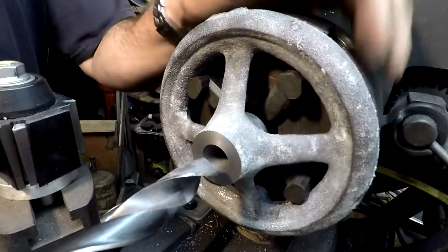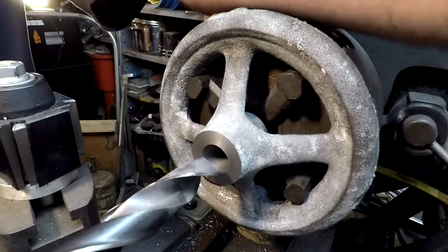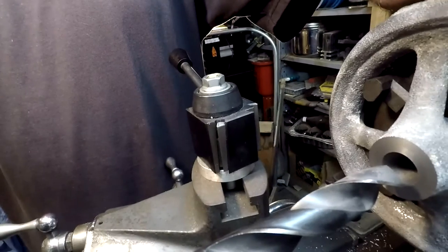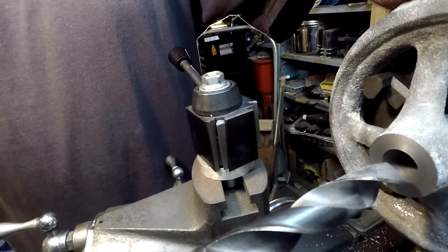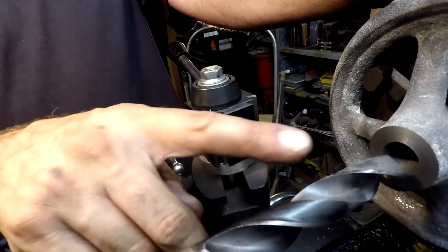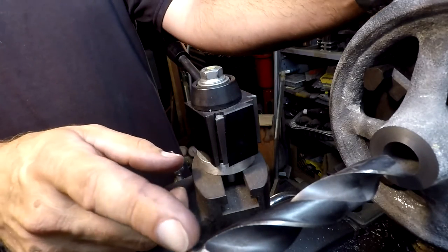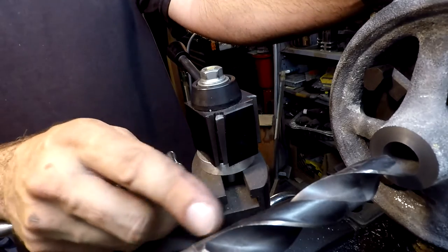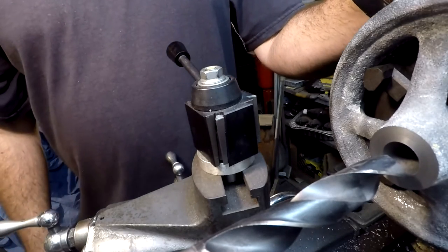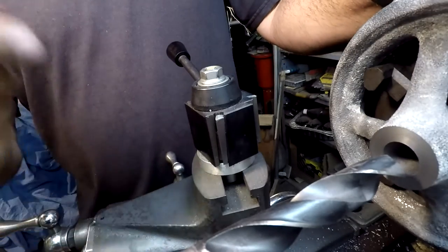All the way through. That's a 23/32" drill. I picked this up at a used machine store not far from where I live. It's a Morse taper 2 drill bit and they had a whole pile of them — all oddball sizes. Everybody grabs up the half-inch and three-quarter ones, but this is very useful for me because it's just below three-quarters of an inch by a 32nd. Now I can use my expanding reamer to open this hole up to the right size.